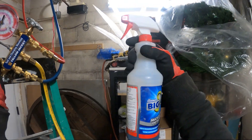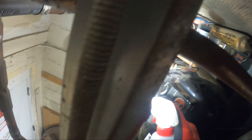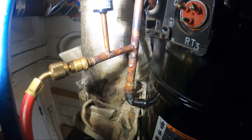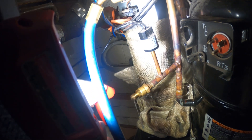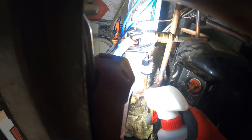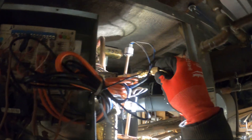Using our micro leak detector — this is a soap and bubble solution. We're going to check for leaks. That spot is not leaking but I do want to check these pins, specifically this one. Let's check around this pipe. Right now everything is looking good. We have no leaks from here.